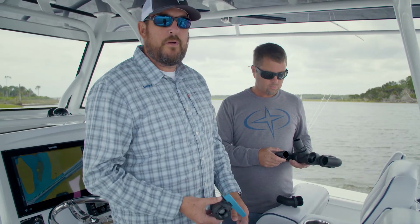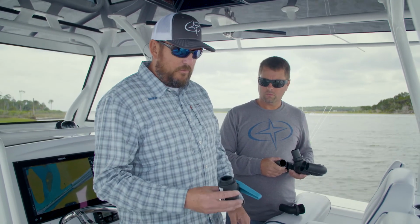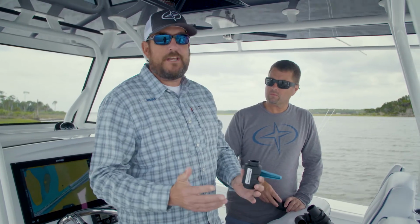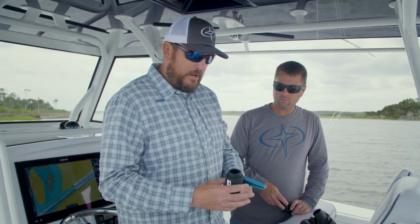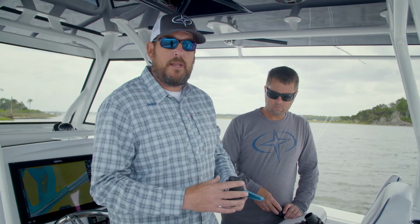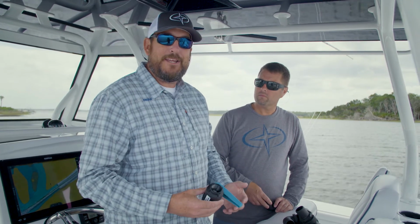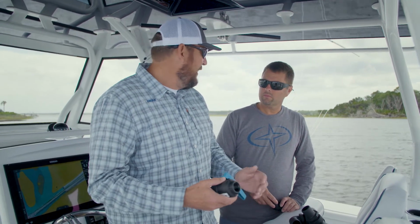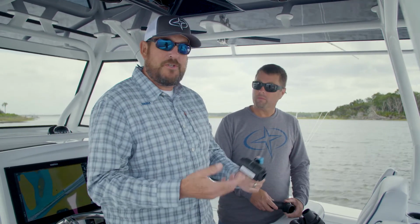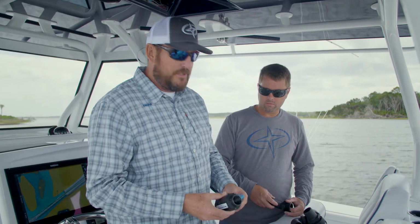One of the things that we don't have to deal with here in Jacksonville, but up north, is that freeze is a real big deal. With these valves, we have tested these by trapping water in them and then closing them, which is a worst case scenario, not something we'd recommend. But if you were to inadvertently do that, the ball valves are designed to withstand that freeze, even with the expanding water and all that. So again, you get your boat back at the end of the cold winter and you want to put it in the water, and now you've got stuck handles and you're trying to break them free if they're bronze, or rusted shut if they're stainless. But with these, it's time to go fishing. You're ready to go. So it's just a better product.